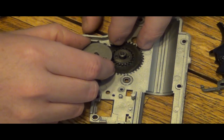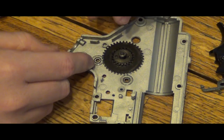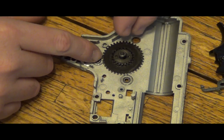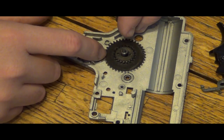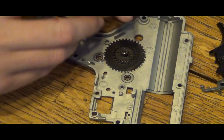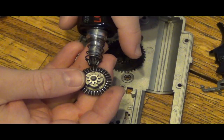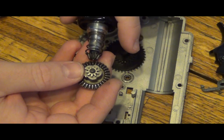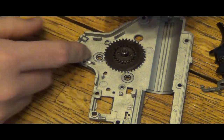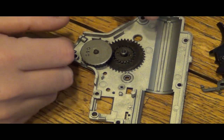We want to know the gapping difference between these teeth and these teeth. Now, you don't have to be just 0.1 millimeter higher than this section so that it gets the most contact. That doesn't need to be. That's only when you go in with the pinion and the motor, the pinion and the bevel. Because if this isn't close enough or in the right location, this is what's rotating. However, let's say you put 0.2 millimeter on here, and you still got at least 50% contact.